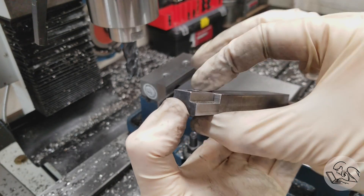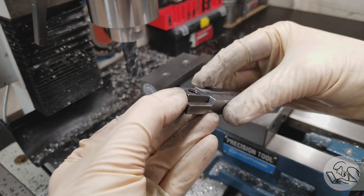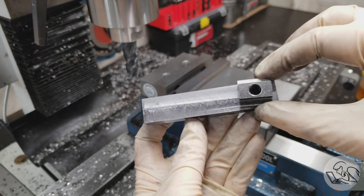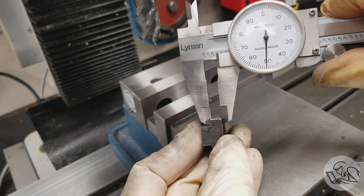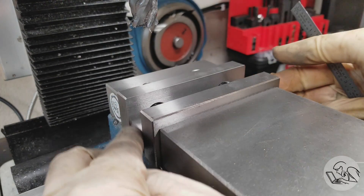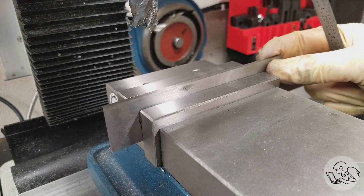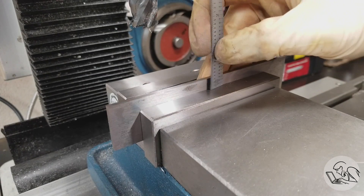After that squaring up, you can see the silhouette of our T-nut — all looking good. We just need to put the shoulders on that stock now. You can see the length for four of them. To cut these shoulders I need to know what the final depth needs to be — I've got 250-thou thickness on the lower portion of the T. I need the right height of parallel, so an easy trick is to put the stock down first and quickly iterate through parallels above it, checking how much is sticking up.